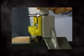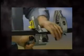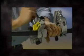By estimating the necessary depth above the conductor, adjust the blade. Begin to rotate the tool and apply a slight forward pressure on the knurled knob to engage the blade in the jacket material. As it engages, carefully watch to assure the blade does not contact the underlying neutrals. Adjust as necessary. After one complete revolution, assuring the blade is not contacting any neutral or conductor, continue stripping.